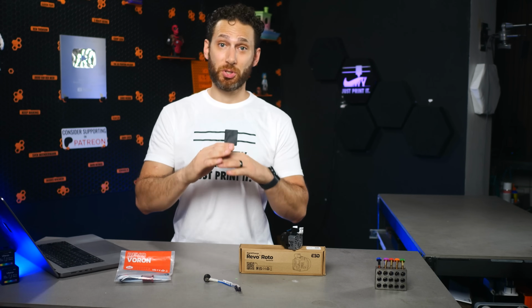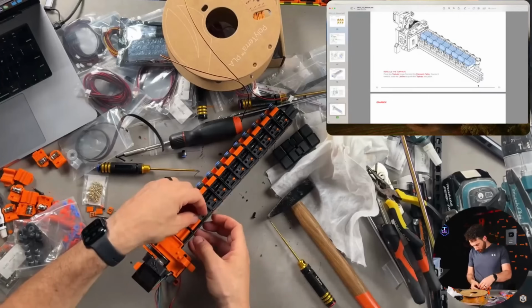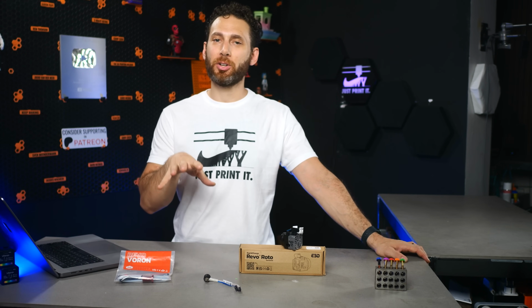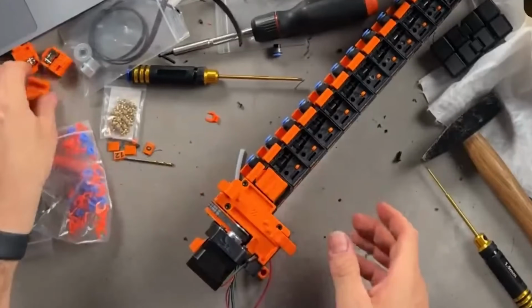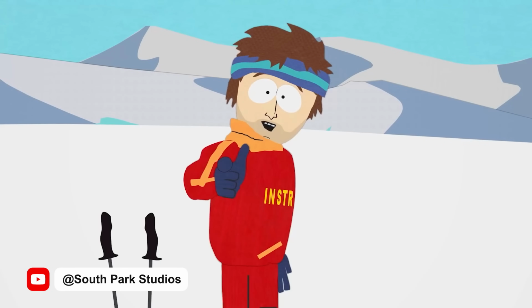In case your issues don't go away or you still have major slippage, you might need to reprint some parts such as the top hats to get better clearances. As ERCF team member Ivan Trail pointed out when he was kind enough to actually consult with me on this video script to benefit all of you, you really can't overstate how important print quality is when you're talking about printing the ERCF parts, especially for the filament blocks. They each need to close completely except for the magnets causing them to hover, and if there is any resistance to them closing except for that magnetic repulsion, you're gonna have a bad time.